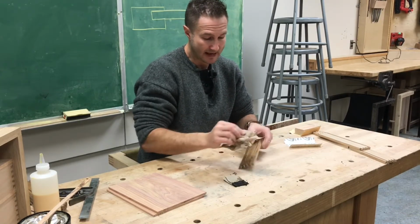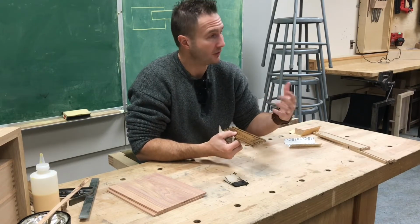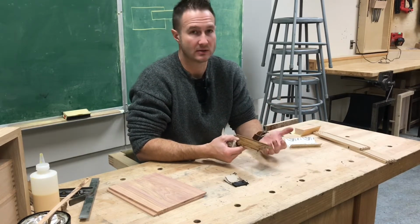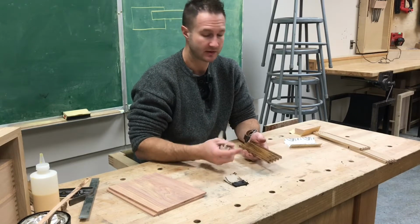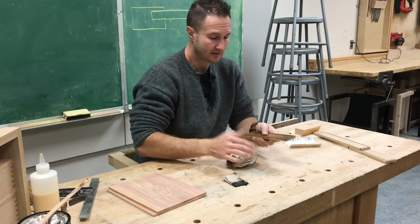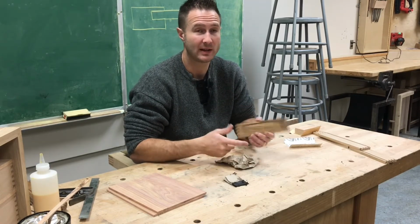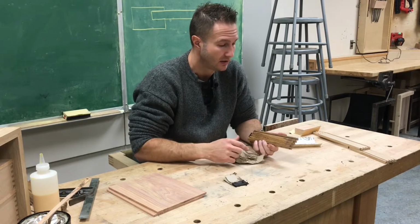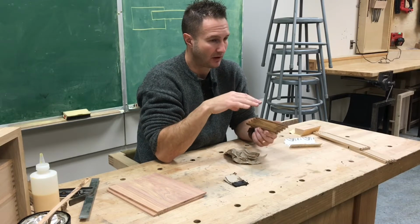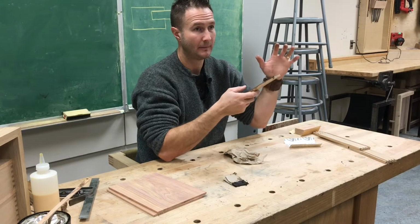You should be able to handle this piece right away. This is very different from what we call a film forming stain or a paint, where obviously you wouldn't wanna touch that surface until it dries. Penetrating oil stain goes into the wood, buff it off 10 minutes later, and it's good to handle, good to touch, right? So in that way, it's really nice for us because at the beginning of class, you can go do your staining, buff it all off, and then take all of your pieces out of the stain room and go stack them in your locker.